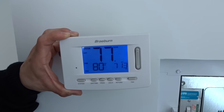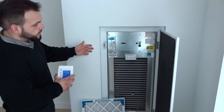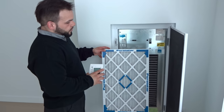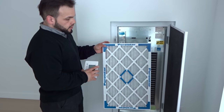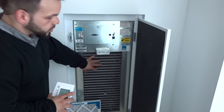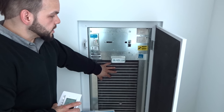And lastly I would like to introduce you to your heat pump. Your heat pump does both heating and air conditioning. You have your MERV 13 filter, which is a minimum efficiency reporting value of 13 — it will capture small particles and prevent them from going into your coil, keeping your coil nice and clean.